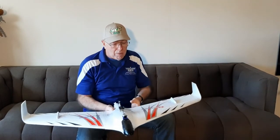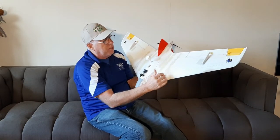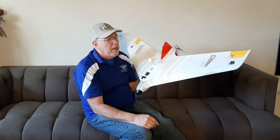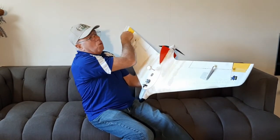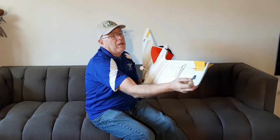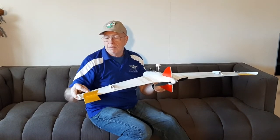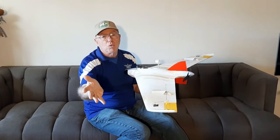To that end I modified my first Opterra quite a few times, and this is its most recent configuration. You can see some putty on the wings from where I tried alternate vertical tail positions and alternate sizes, and what led up to this is my desire to have wingtip drag rudders. These yellow objects out on the ends are wingtip drag rudders. They deploy as speed brakes and they can also move differentially left and right for yaw control — the idea being that one speed brake popped up on one wing will drag that wing back, producing yaw control.